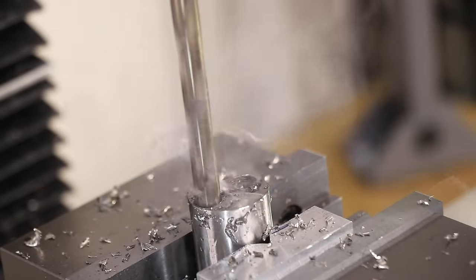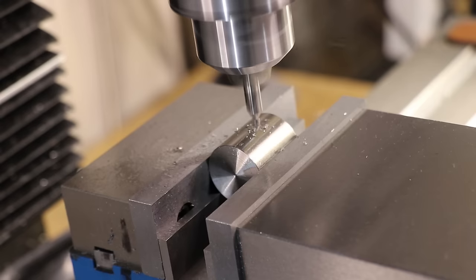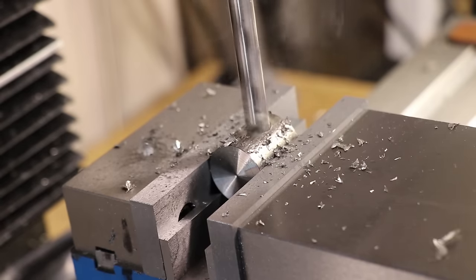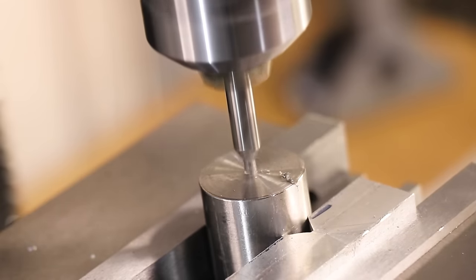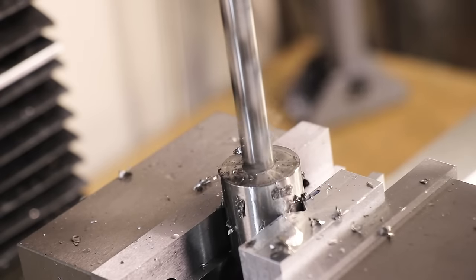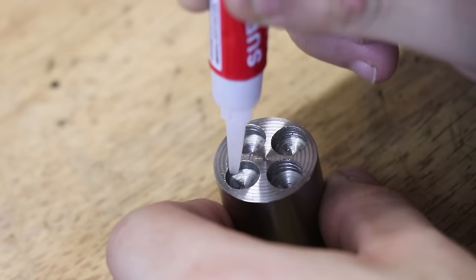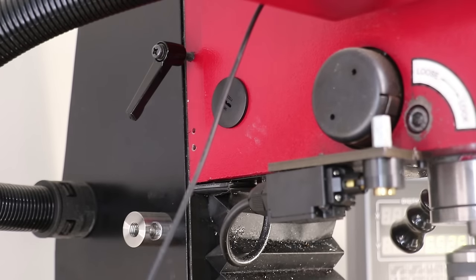Because I'm using the mill, I opted to use four magnets instead of one, so I'm drilling four holes. I'll flip the part on its side and drill a hole through to accept coolant. It's been a while since I drilled 316 stainless steel, and I really forgot how difficult it was to drill, at least compared to the other steels I've been machining. With all the holes drilled, I'll tap the two holes for M12, then use some glue to hold in the four magnets. The part sticks to the mill with a lot of force, so I'm pretty happy with that.